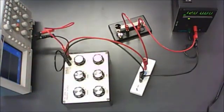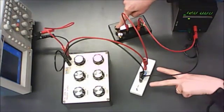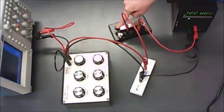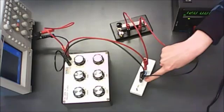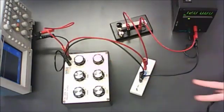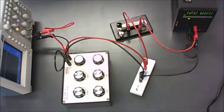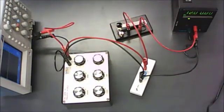That's your completed circuit. When you press the tap key down, the capacitor rapidly charges up to 12 volts. When you release it, it starts discharging — the stored voltage drives charge carriers through the resistor. However, the capacitor can't maintain 12 volts indefinitely like the power supply can, so its voltage will decay, which means the current will also decay over time, and you'll be able to watch that on your oscilloscope.